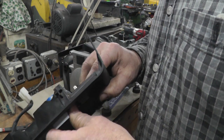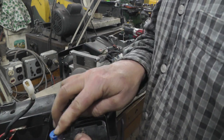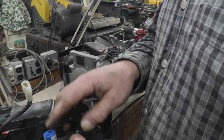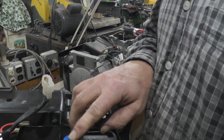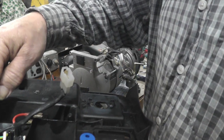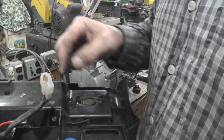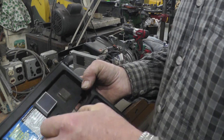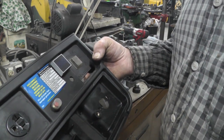I'll go ahead and get this other hole done. The wiring is going to be simple — these two meters will be in parallel because they just need voltage to them. This is the voltmeter and this is frequency. They will just run over here and go underneath the screws, with the neutral and the hot. That's all there is to it. Then it's just a matter of assembling it and giving it a whirl. Be back in a little bit.